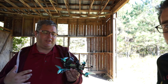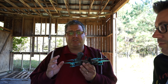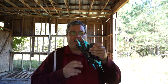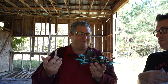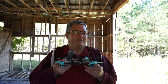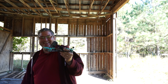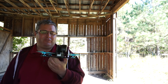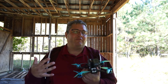So here's your quadcopter. The way a quadcopter flies is pretty simple. There's something in here that measures how fast it moves in different directions. There are three measurements a quad uses. There's one that measures pitch — how fast it's moving in that direction. There's one going the other way, which is the roll axis. And there's one that goes this way, which those of you who might know is the yaw, or rudder. Even if the gyro isn't oriented that way, you can actually do it at 45 degrees and then do some math to figure out those movements.